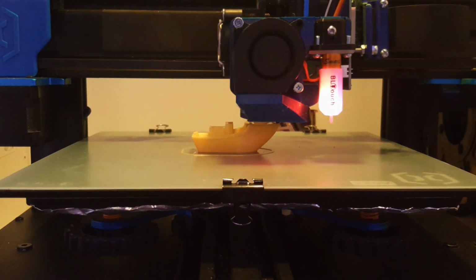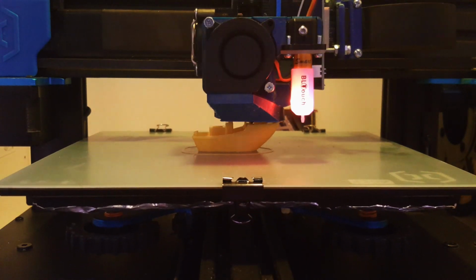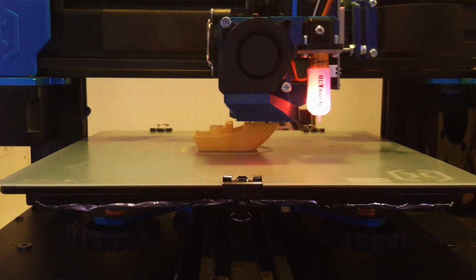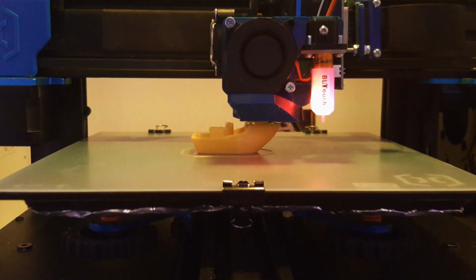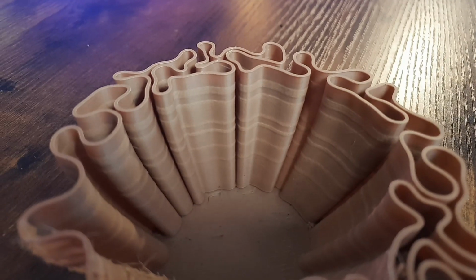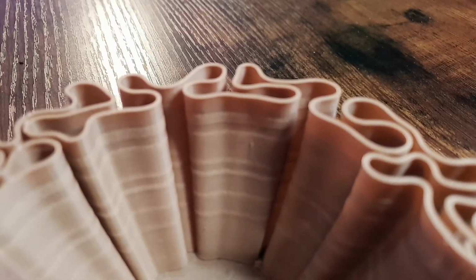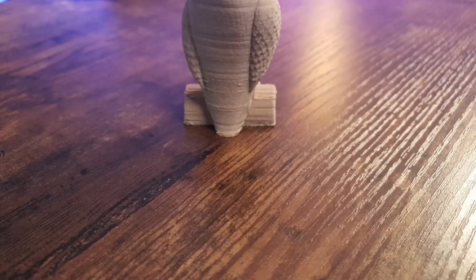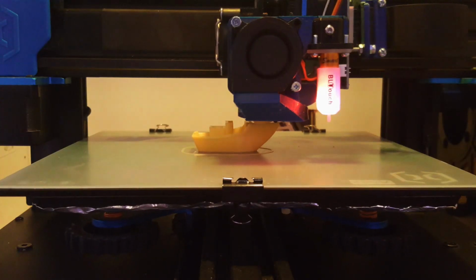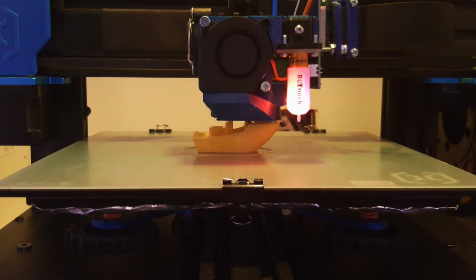Do not buy a cheap filament under any circumstances to start. You will only get annoyed, and under certain circumstances it will take away your desire for 3D printing. Buy decent branded filament. At the beginning, definitely use standard filament. That means don't use filaments like fluorescent filaments, glow in the dark, wood filaments, filaments with stone, and so on. For these filaments, you sometimes need special equipment like hardened nozzles. As beautiful as these filaments are, as long as you don't feel confident in the area of 3D printing, you just add another component and you just don't know where to look anymore.